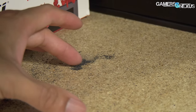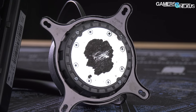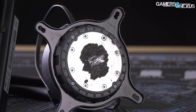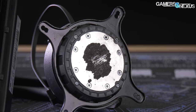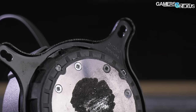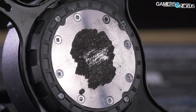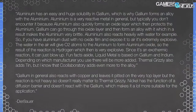The cold plate becomes weaker, and you can start to see pitting and corrosion in it. This is because aluminum is highly soluble in gallium and will form an alloy with it. Typically, aluminum builds an oxide layer around itself which protects it from exposure to other elements or air. Gallium penetrates that oxide layer and causes gallium and aluminum to form an alloy. To better understand this chemical reaction, we asked Derbauer for an explanation of how liquid metal interacts with various metals.